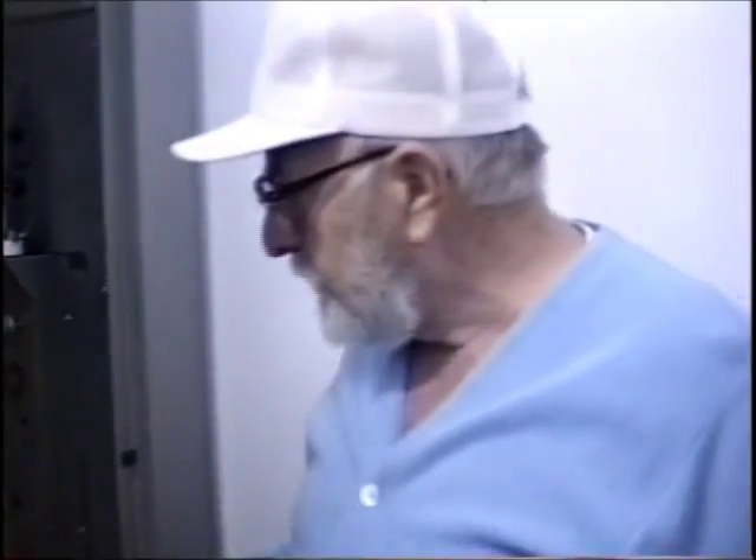One was an antenna changeover relay and a control circuit down here to incorporate my push-to-talk. Push-to-talk has to do several things: it's got to mute the oscillator in the transmitter, and it's also got to switch the antenna circuits and key the main contactor to put B-plus onto the transmitter.